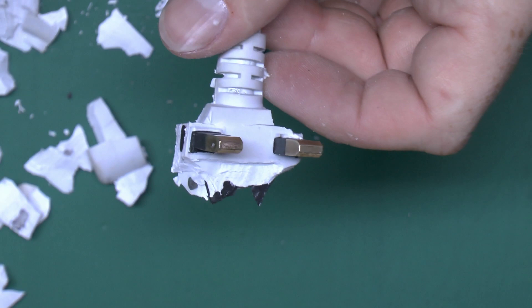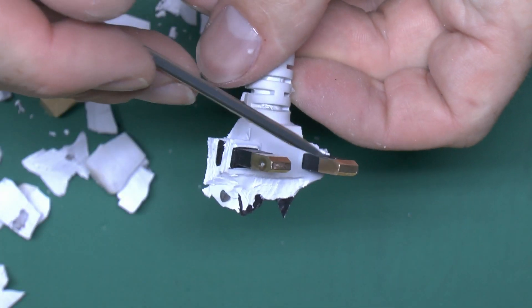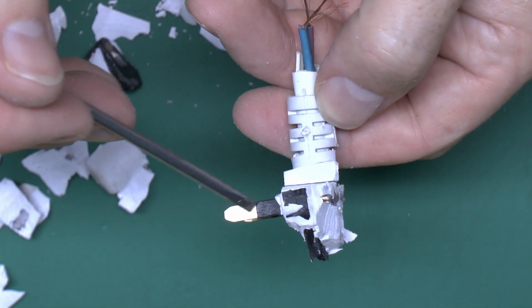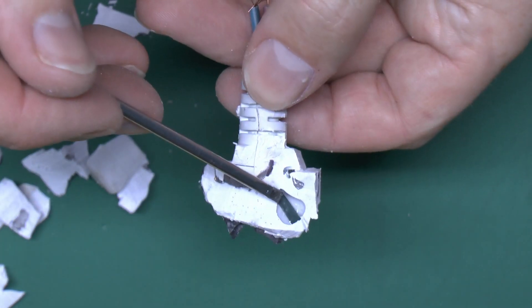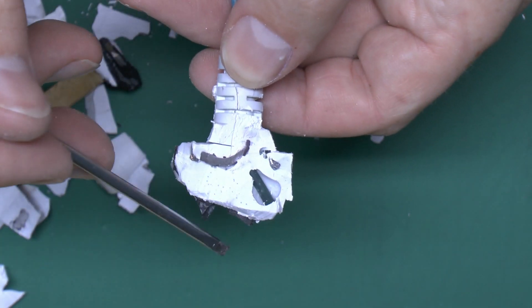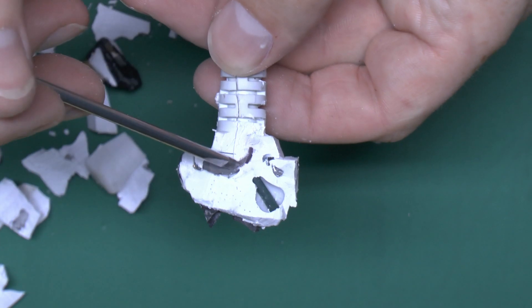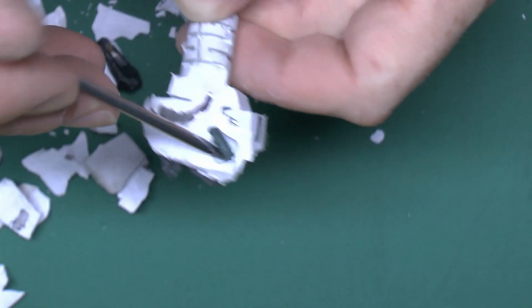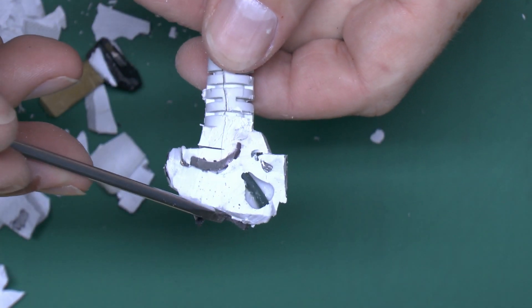I've actually managed to break the earth pin off because the plastic is incredibly brittle — and there's nothing connected there at all. Here are the two remaining pins, line and neutral. You can see this brown wire coming across to the back of the line pin, and the neutral wire goes into its pin. This bit here is the green earth wire, which they've basically just shoved up here — and of course it doesn't go anywhere because the earth pin was at the top. They literally just shoved it in, moulded the plastic over the back, and only the line and neutral were ever connected. No attempt was ever made to even put the earth wire near its terminal — that's why there was no continuity. Simply a poor manufacturer that just didn't bother to connect it.